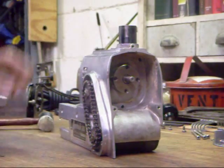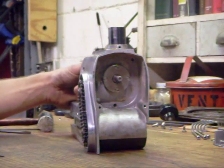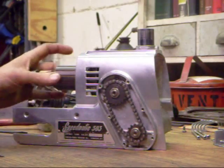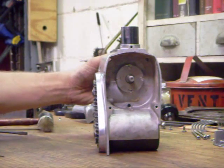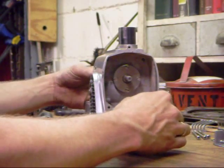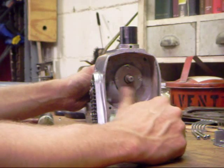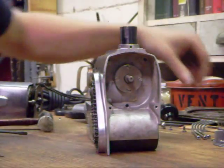Now that we have the seal and its housing in place, we're going to reinstall our fan. If you rotate the armature at this stage, the chain does not move — it'll twitch a little bit. That's normal because there's nothing binding that worm to its actual spindle; it's just rotating on it. Every step, it's not a bad idea to make sure everything works freely — you don't want to bind this up. A common cause of problems would be if something were causing this worm drive to bind, which will cause the armature to overheat. But we're going to install our fan now.